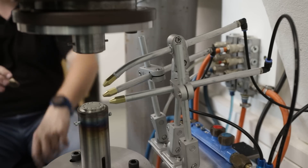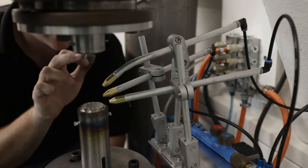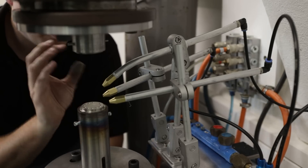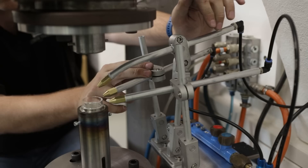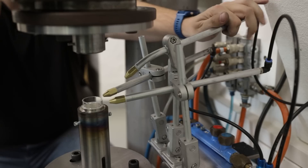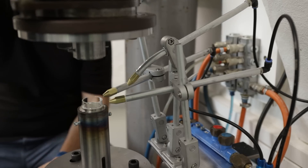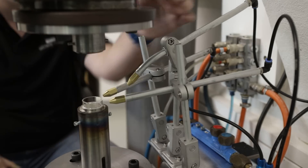The mechanical part seems to be finished. We have here three burners. The interesting thing is that these are the exact same type of burners that are mentioned in the RCA document. It's fun that you can still after 70 years order the same parts from the same company. These two nozzles will be aiming at the glass ring all the time and this one is movable, so I can hit the center and then take it out before pressing the glass.